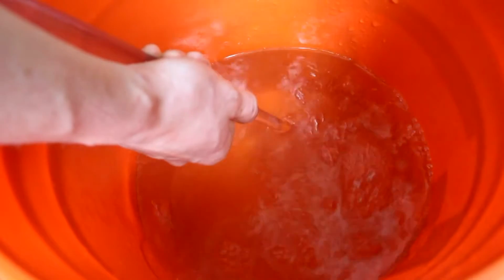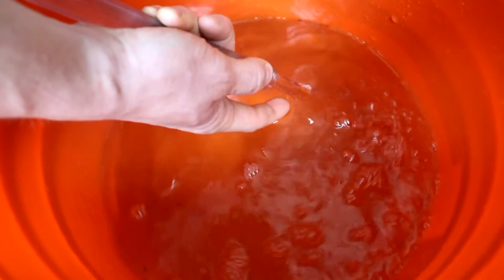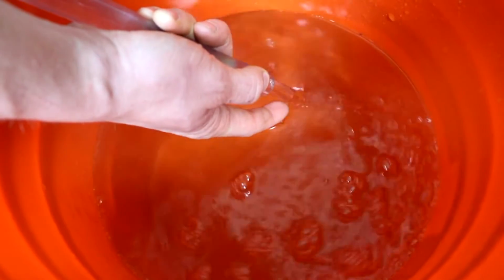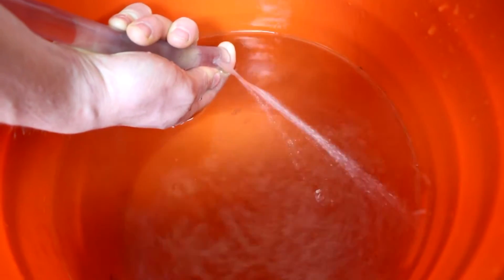You see, if I try to stop the water flowing, it creates a pressure spike just as I'm turning it off. Electricity does the same thing when it has some energy stored in a magnetic field, except instead of a pressure spike, it creates a voltage spike. Voltage and pressure in this context are equivalent. Now, if I put a small hole in the end of the tube, as you can see right here, I let the water flow, and then when I shut the water off, the water is shot through that tube with a very high amount of pressure. Now, I should be able to use this to pump a small amount of water up a great height.